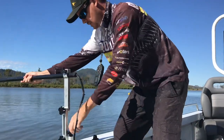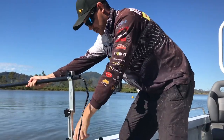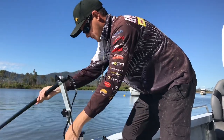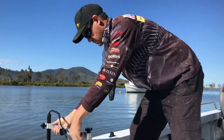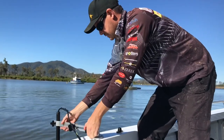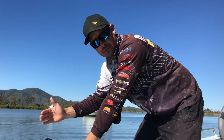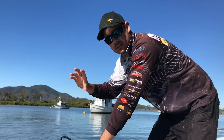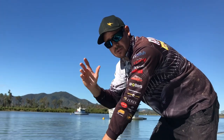Just unscrewing, put it around to the side — any position that you want — tighten it up, loosen it off, into the water. Make sure in your manual it'll tell you which way the transducer is supposed to face, so make sure you have that the right way, otherwise you'll get your images reversed on your screen.